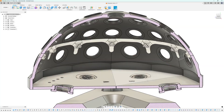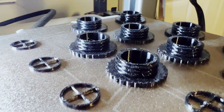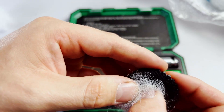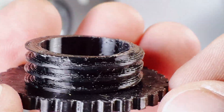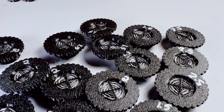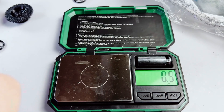About those aperiodic vents: they're a controlled leak, a resistive path that lets pressure bleed off in a controlled and predictable way. I printed replacement cartridges so I can pack measured polyfill and tune by mass and compression. The trapezoidal threads make on-the-fly tuning easy. I'm starting with 20 centimeters squared total of vent area split across six vents, and one and a half grains of polyfill per cartridge.